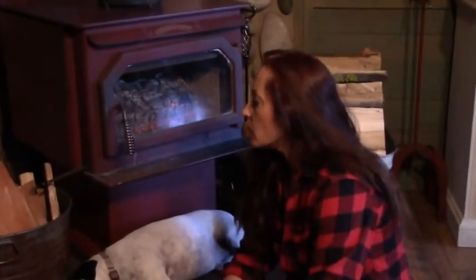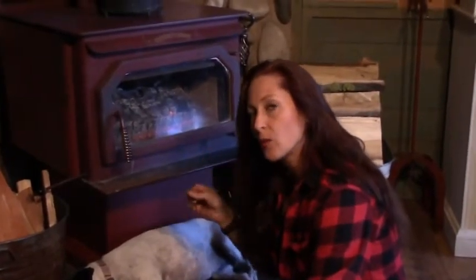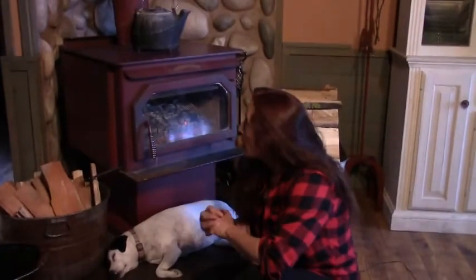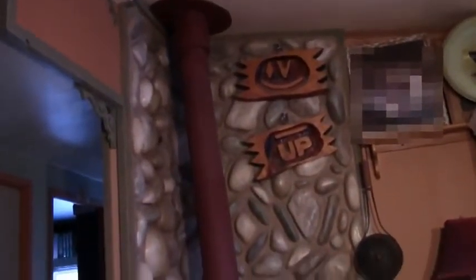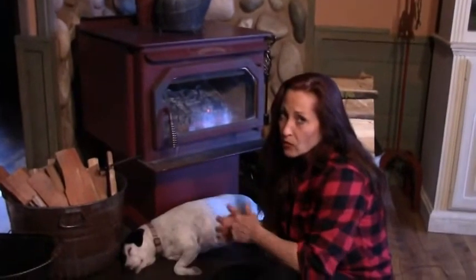And there are people, which I talked about a little bit in my other video on how to install a wood stove, that have to do other versions of a backdraft, where they maybe have to put in some duct underneath their stove or some other place where they can draw air in from the outside to get those fires going. And a lot of it again will have to do with how straight your pipe is. If you have no elbows and no angles, that helps a lot.